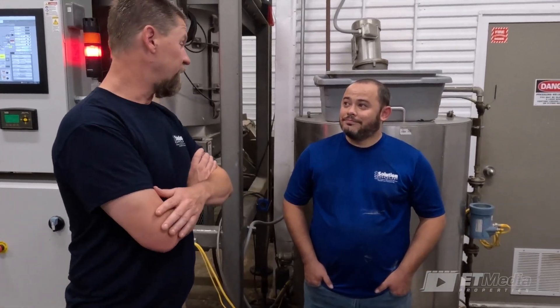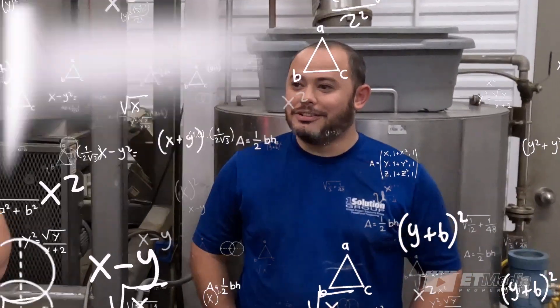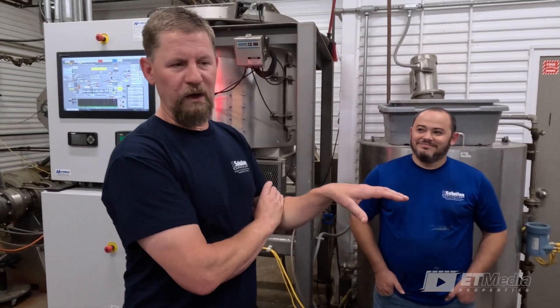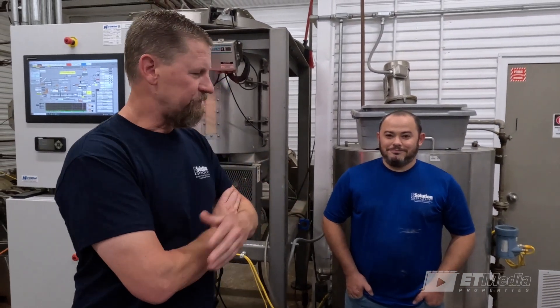Let's assume we have three good numbers. We'll find out how much weight it is per percentage. With that, we can then calculate what our expected screw factor is in a volumetric mode and use that to double-check our gravimetric feed rate set points. Thank you very much and y'all have a good day.